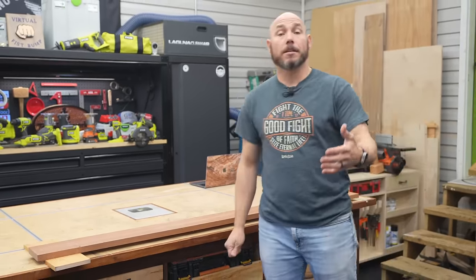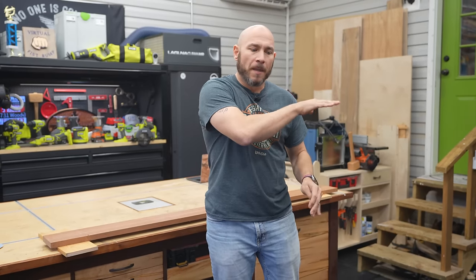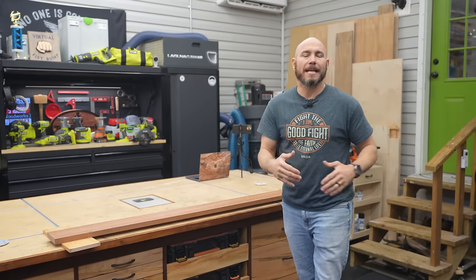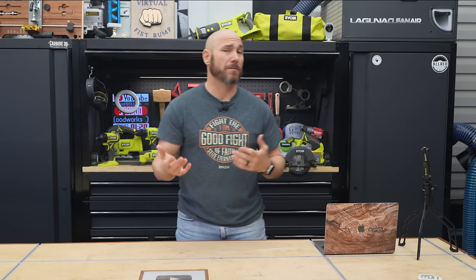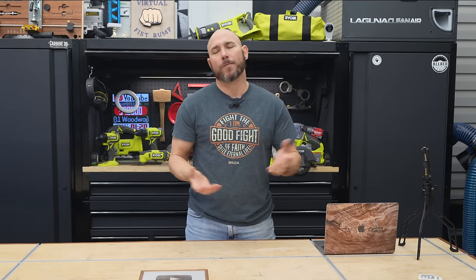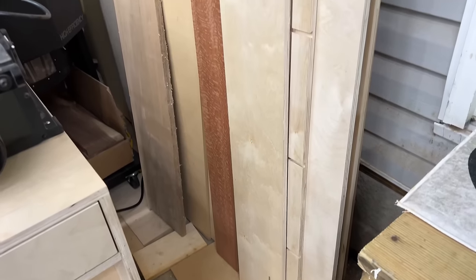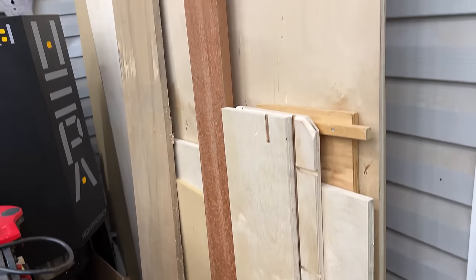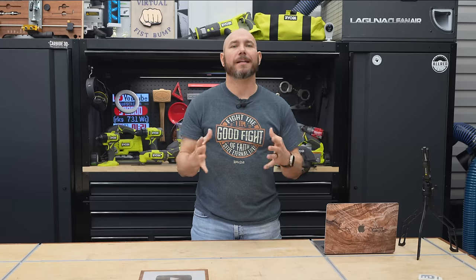Another consideration: my garage floor is extremely unlevel — over a course of two feet it may drop two inches in some places. So you have to account for that unevenness when building your supports. If stacking on the ground, be sure to account for that. Now, plywood really doesn't apply to most of this as far as moisture is concerned, because it doesn't absorb moisture and expand and contract like regular wood does. It will absorb moisture, but it won't expand and contract. It does need to be stored flat or vertically straight up and down, because it will bow over time if humidity and temperature are changing.